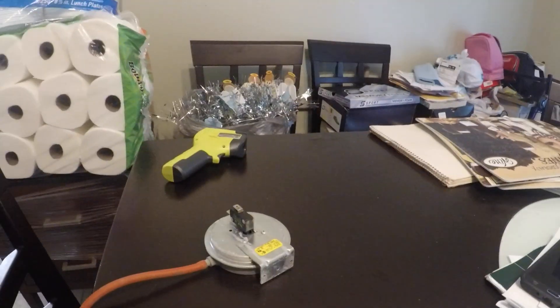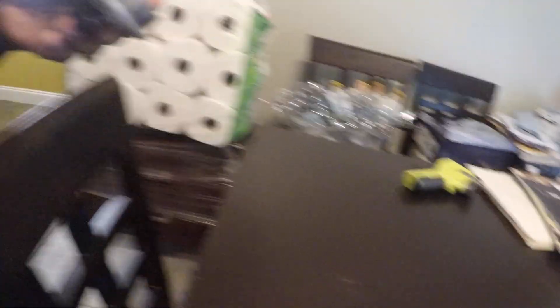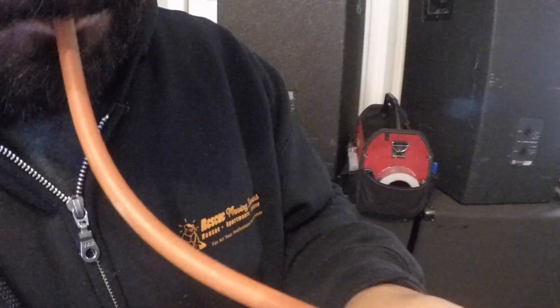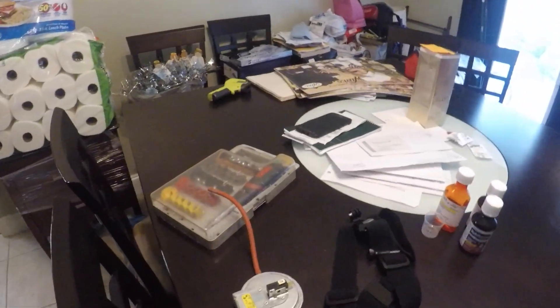If you don't want to take it off, that's fine. All you need is a new small hose — like this — just to blow and suction air to the pressure switch. It's like a vacuum pressure switch, so just blow into the tube and suction it, back and forth, a few times. This quick tip is gonna fix your furnace and get it working again.